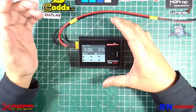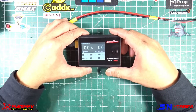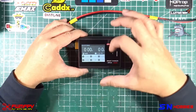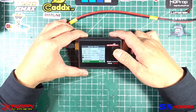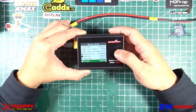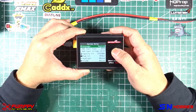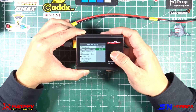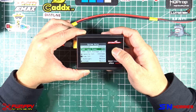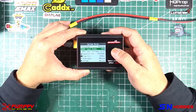We'll try a charge run to see if we can reach the rated numbers. This charger can also check internal resistance while charging. If you press and hold the button for a few seconds, you get into the system setup menu. Language is set to English. Maximum input power is 450 watts — you can lower it, but at 450 watts, doing the math you should be able to achieve that with close to 25.2 volts on the input side.